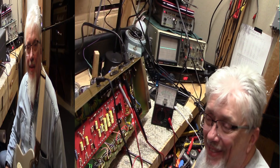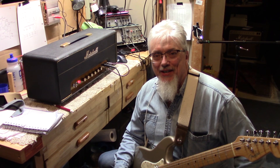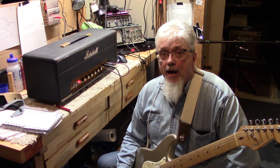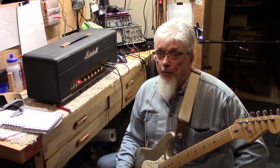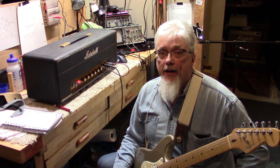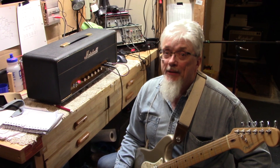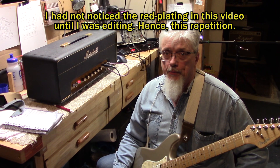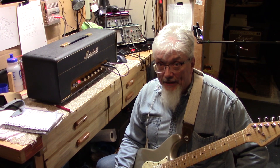I got the Marshall back together. Since the beginning of the video it's been a day or two — I had to wait for some tubes to come. When I put it back together after fixing the tube socket and input jack, I was playing it and it started making a really loud humming again. When you hear a loud 60 Hz hum — a lower frequency — it usually means one of your output tubes is gone, probably red-plating. I couldn't find anything wrong, so I swapped the KT-66s from socket to socket, and sure enough, that same tube red-plated in the other socket after playing for a few minutes. So it's got some new KT-66s in it that the owner brought over. Everything's fixed.